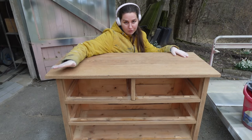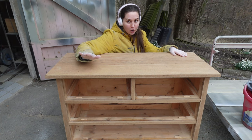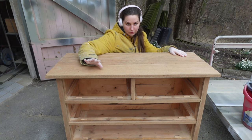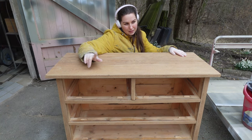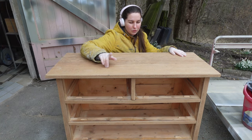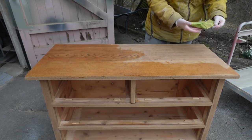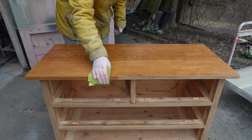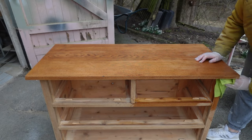It took me maybe four or five hours to sand and scrape this piece, and honestly I wish all of my projects went this fast. Now all I have to do is clean it, and tomorrow I'll come back and show you what's next. Before I closed my workshop for the day I cleansed the chest with hot water — doing that you can also see what the piece would look like if you applied varnish without applying stain or paint wash first.